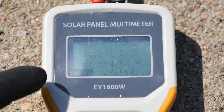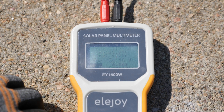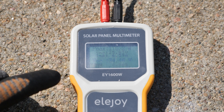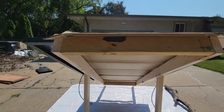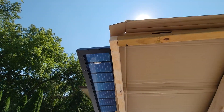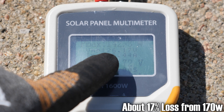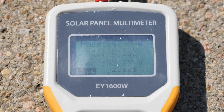The shattered panel is producing 171.4 watts, 26 volts under load, and 6.59 amps — honestly not as bad as I expected. With cardboard on the back side covering the entire panel except for a little strip on both sides, it dropped to 141.9 watts, 26 volts under load, and 5.4 amps. It only went down about 20 to 30 watts — pretty interesting.